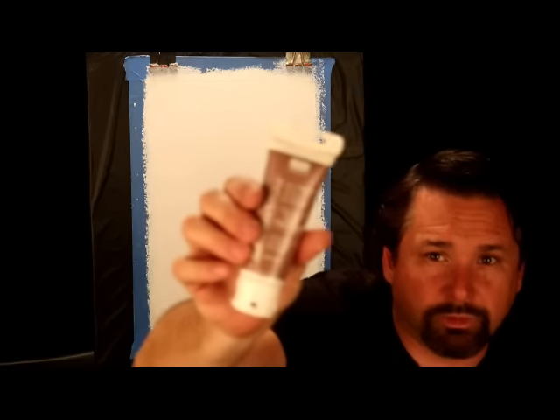What I'm using, based on what the architect wants, is a color pack from Modern Masters. It's one of what they consider a shimmer stone color, but it's a universal color that works in a lot of their products. This color is called Chocolate Raspberry. For the rest, we're going to do a three-color process, basically blending and building layers - Chocolate Raspberry in full strength, knocked down 50%, and then about a 10% mix. Same color, just variations to get what we're looking for.